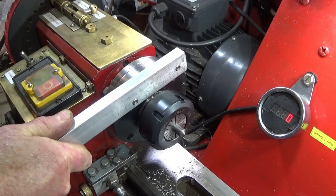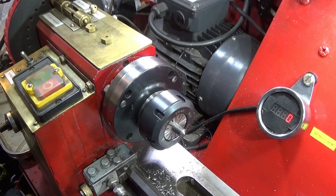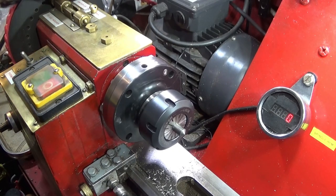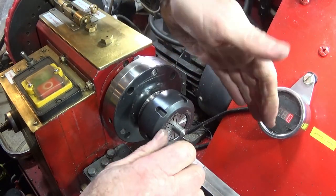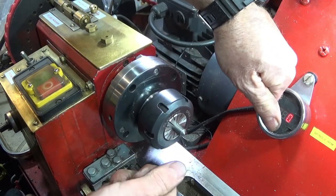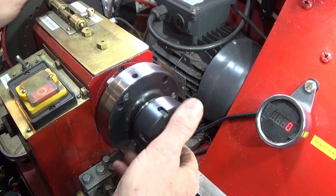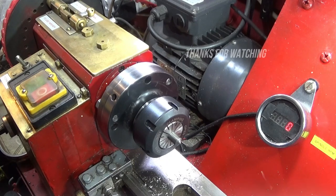It's a very effective handle and I can get that collet chuck up nice and tight. These collet chucks are excellent for holding threads and great for high precision work. As I showed with the file, they're nice when you're filing a component because you haven't got jaws to get in the way and knock your hand. It's much easier and safer to use one of these for polishing and things like that on the lathe. I totally recommend the ER40 collet chuck from Banggood — it's well worth the money and a brilliant piece of kit.